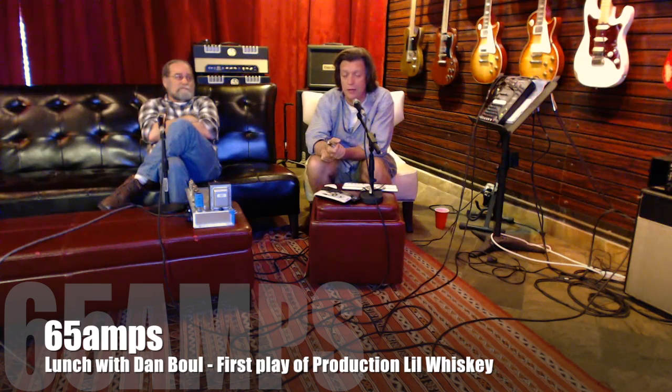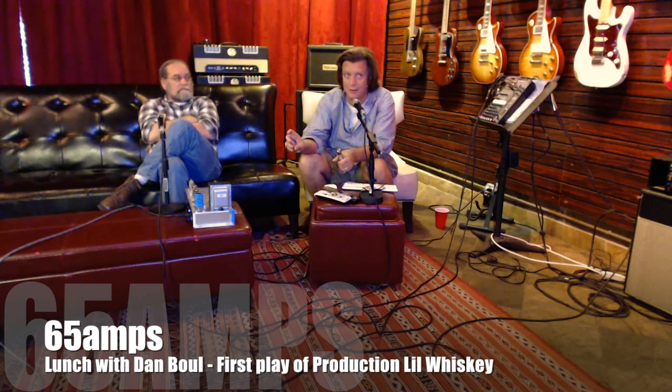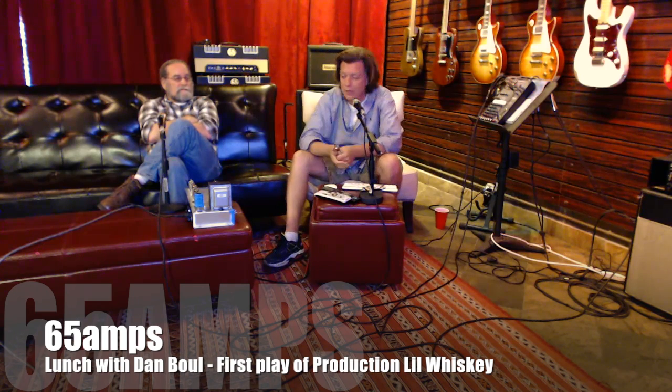And in my opinion, the only really good 84s out right now are JJs. I highly recommend those. The other ones sound good, but the JJs... when I was building the first London, they sound the most like vintage ANOS. I had Mullard EL84s, Telefunken EL84s, Amperex EL84s, Valvo EL84s, Tungsram EL84s. And believe it or not, I like the JJs the best. The Mullards are really good, but they had that really narrow mid-range notch that Mullards can have. Not like Mullard 34s, which are a lot broader, but the JJs are fantastic.